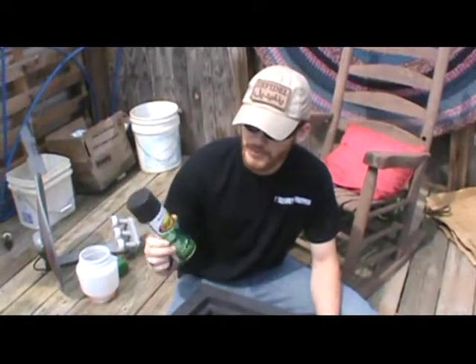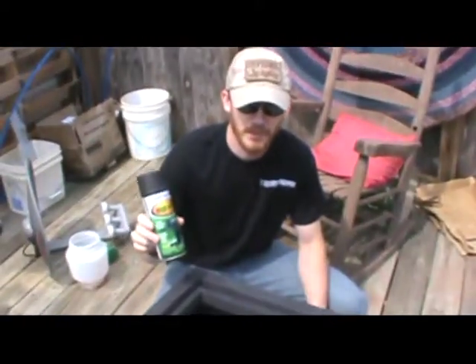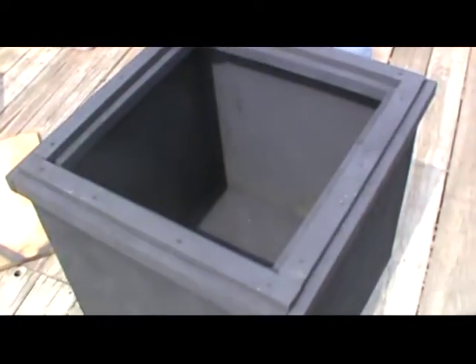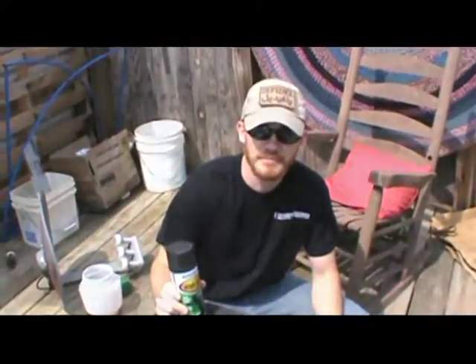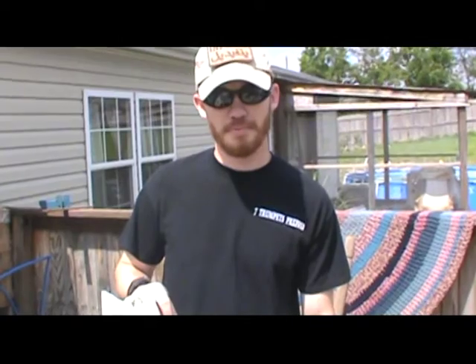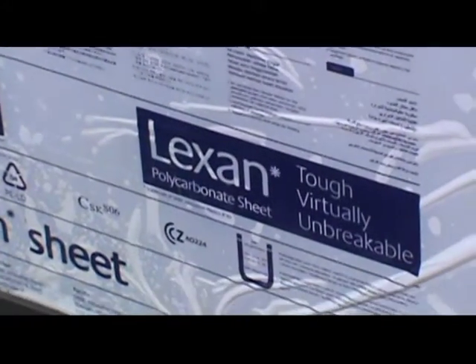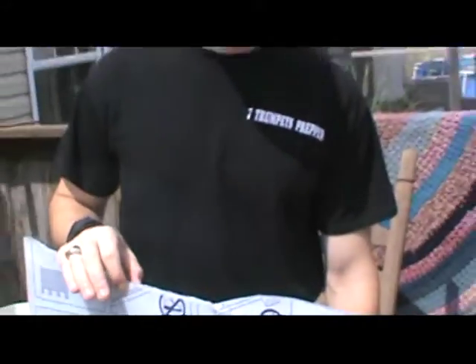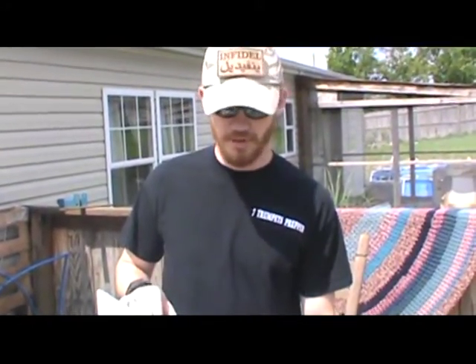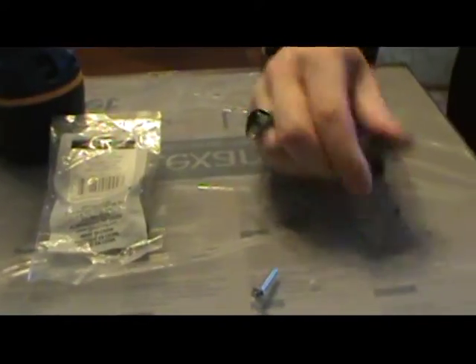We've just finished painting. We used Rust-Oleum high heat paint, which is good up to 1200 degrees. When you're painting, be sure to get a very good coat on the inside — on your sides and especially on the bottom, since that's where most of your heat is going to be. We're now cutting out our lid using a repurposed piece of scrap Lexan glass, three-eighths inches thick. Don't use regular glass or plexiglass — they can break, and plexi gets brittle over time. Lexan will allow a lot of flex and is more versatile.